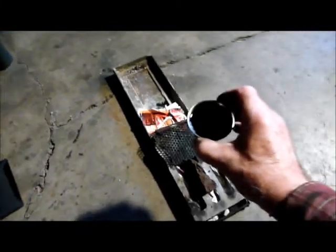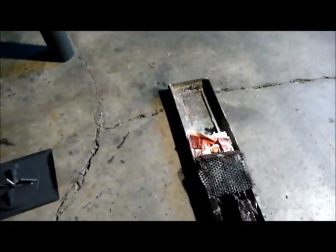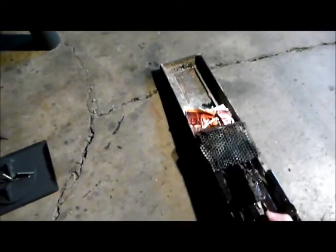I'm going to try something new today. I'll put the cast iron grate on top, and this is one of those man-made logs — just a piece I broke up — and I'm going to set that on top. Here's that oil dispersion grid set on the back, and this is about 3 ounces of kerosene — that's all I use. I'm going to pour that over the top, then slide it inside and get the draft control set.